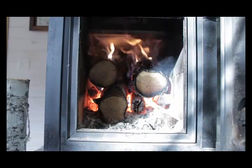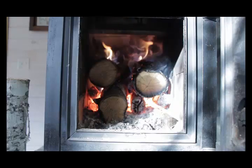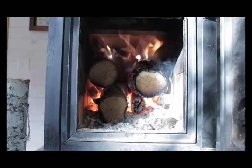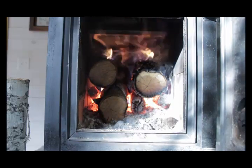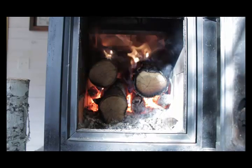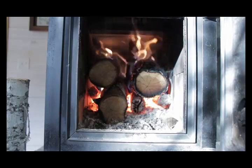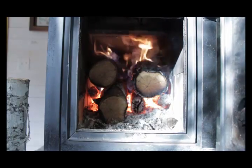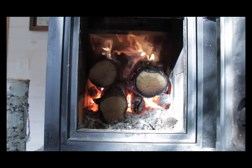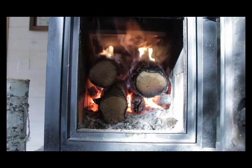If you remember what your Fisher wood stove looks like, the fire never has a boiling action like this, and this is about as inefficient as you can get. The front door is open so it doesn't have a sealed box to make this ultra efficient right here, but you can see just how clean it's burning. There's a little smoke coming off the front where the air is cycling through the door, but from the back you see no smoke developing whatsoever, which is really the goal.